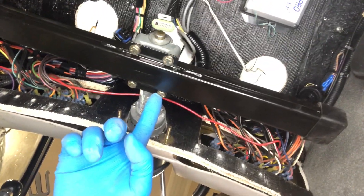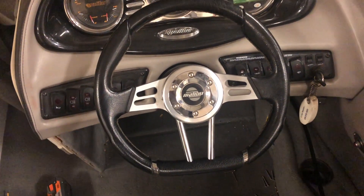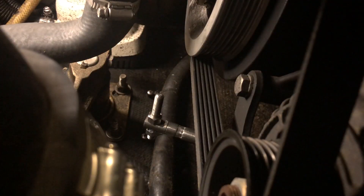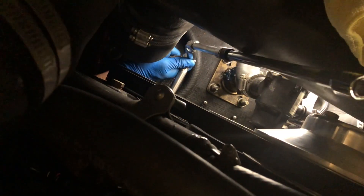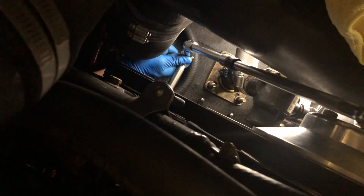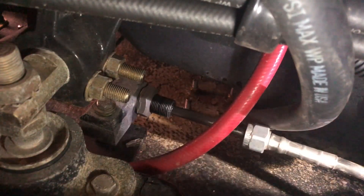You can undo these four bolts and it will drop down. The cable back by the rudder now needs to be prepped to pull it through. This machine piece needs to be removed — we used an extension again to help reach it and a 9/16th socket. Loosen this nut and pull the cable through the tilt tube, and tie your rope to the end of the cable.